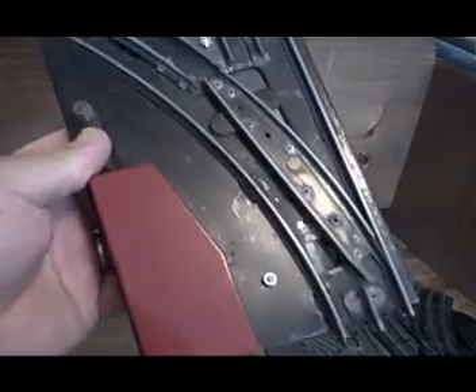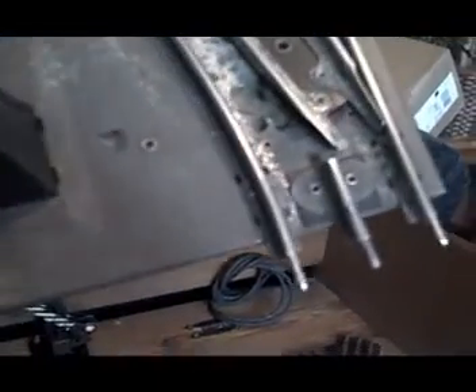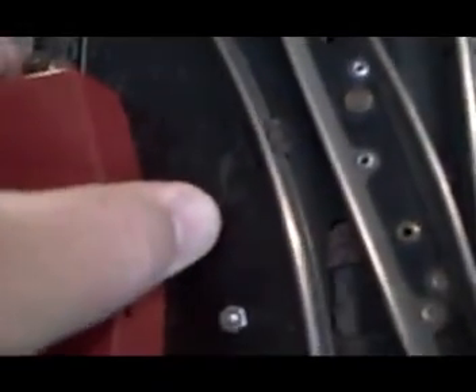I'm going to show you via this mechanical switch track — I drilled out in those two spots. This is not the same as that electronic switch track, but I've already done all of these. I drilled out the two press rivets — there's one there and one there. If you flip this over you can see on the back where it's recessed. On the electronic switch tracks, I drilled those press rivets out with a 7/64 drill bit, and what that does is it properly clearances it for a number four machine screw and nut. I did use a lock washer under there.